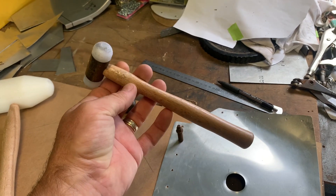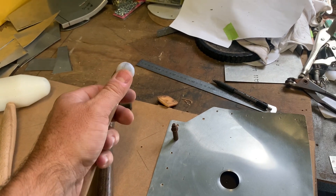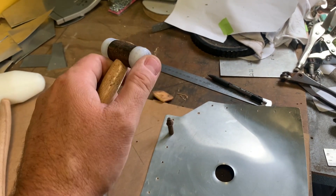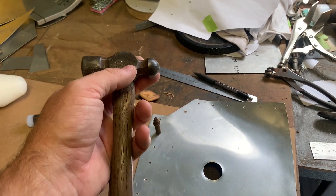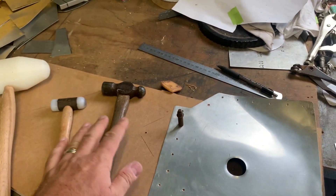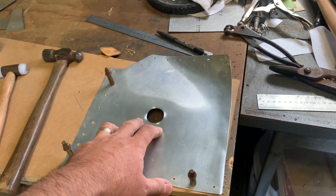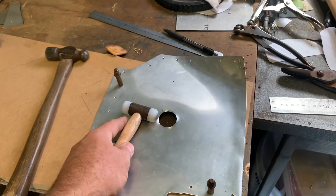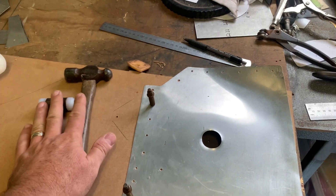It's a cute little hammer — very light. The trouble with that is it work-hardens quicker for the amount of form work you get out of it, but it doesn't bruise the metal like the ball-peen. Even though the ball-peen has got more weight behind it and every blow moves more metal, it's a catch-22 — because every time you hit the metal it work-hardens, so more hitting means it work-hardens quicker and you have to anneal it or risk splitting. You don't want to spend ages tapping; you want the metal to move. So it's a catch-22 between these two.